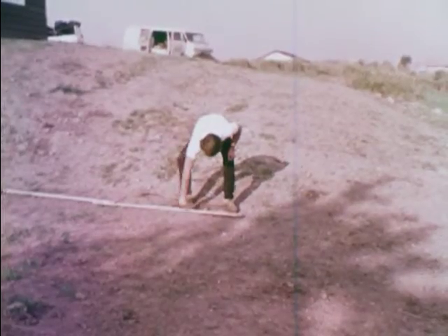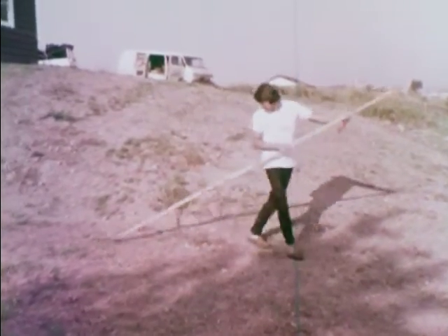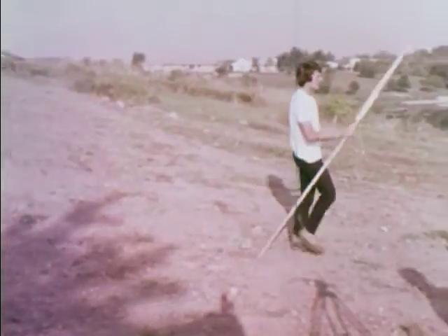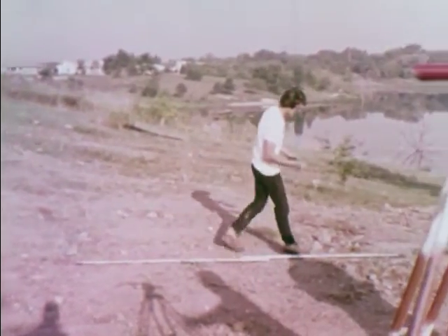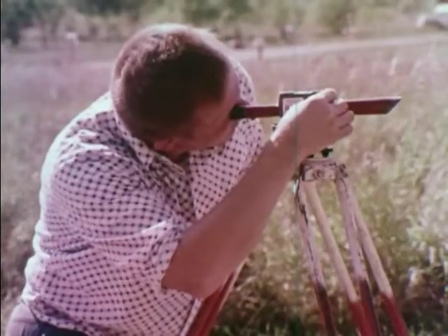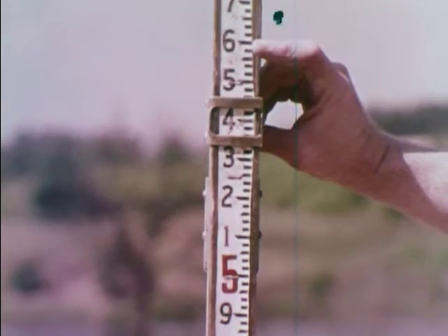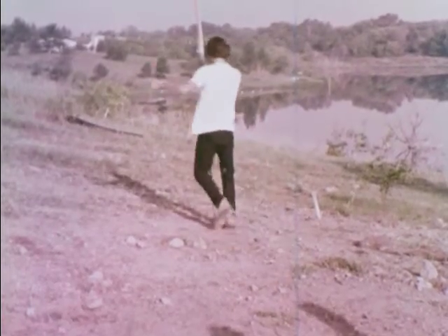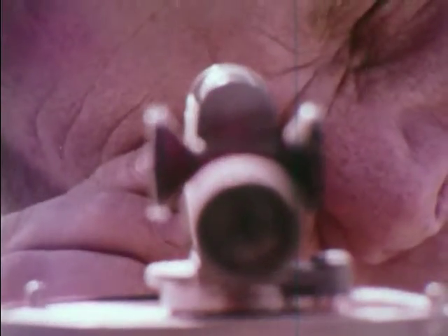The length of the tank is measured and marked, then the distance to the first drop box is measured. A rule of thumb is that the elevation of the first seepage line be the same or lower than the elevation of the flow line of the cast iron at the house. Five foot six is lower — thirty feet is measured off, and we will find the same elevation of five foot six and mark the spot.